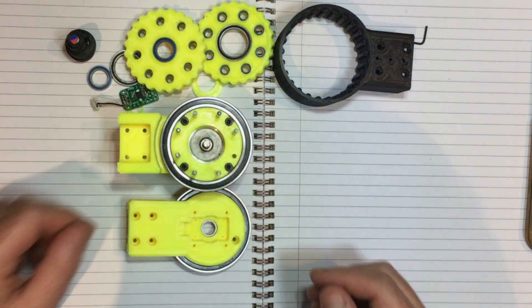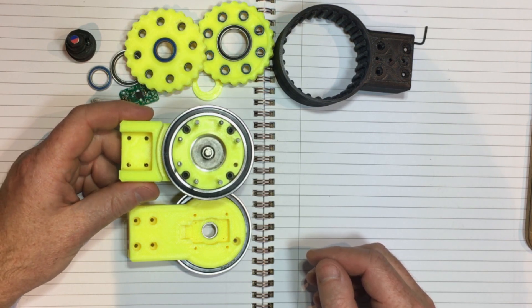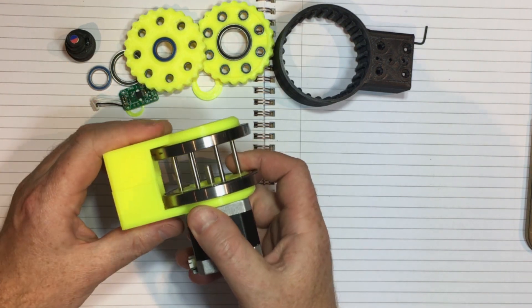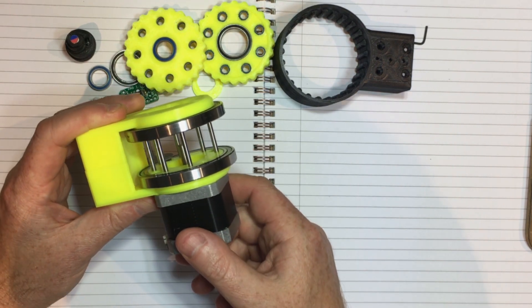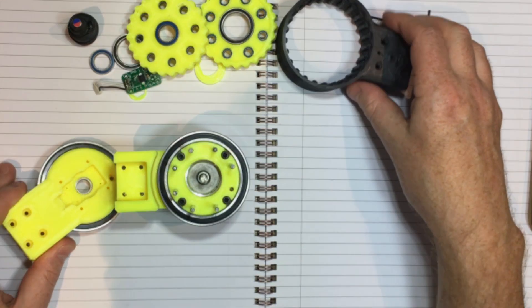It has been improved upon by like-minded open source makers and engineers. I have mentioned a few of them in the past but just wanted to give credit where credit is due. It was Mike Buckingham's idea to put the input, output and main housing concentric. This meant that the input housing can be dual sided making the actuator more rigid. This is more important in brushless cycloidal gearboxes.